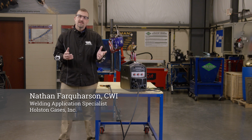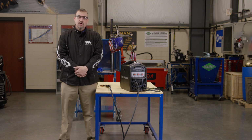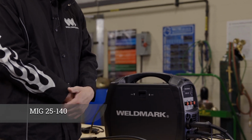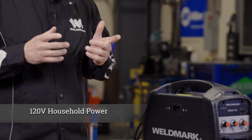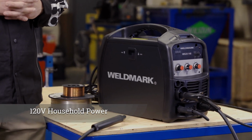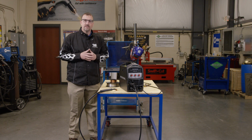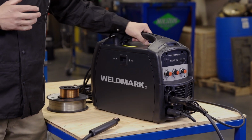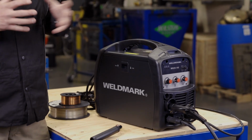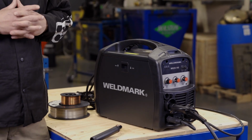Weldmark wanted me to talk to you today about the new inverter MIG welder they're launching, the MIG25-140. The Weldmark MIG25-140 is one of the first 120 volt MIG inverter power sources on the market, and you're certainly going to notice a difference when you start to move this machine around. This machine is 31 pounds out of the box, and it's a lot better than those 50 to 70 pound machines that we're used to toting around.